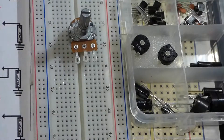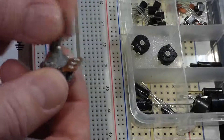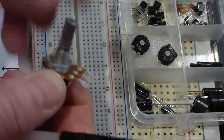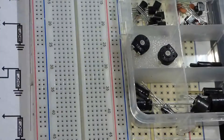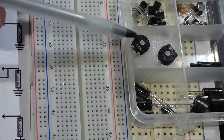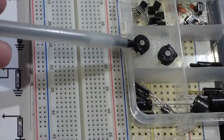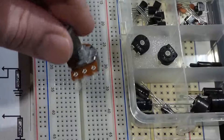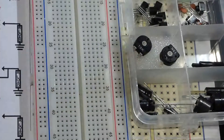We're going to set aside the potentiometer for the rest of this video and just use the trim pot. The potentiometer is made for frequent adjustments — like continually changing brightness. The trim pot is designed to go inside a circuit where you set something once as a fine adjustment and basically leave it, though you can change it later. It's great for breadboard prototyping, so while learning electronics you'll use the trim pot much more than the potentiometer.